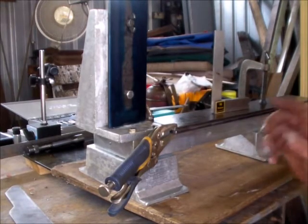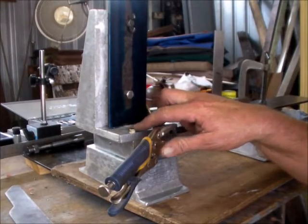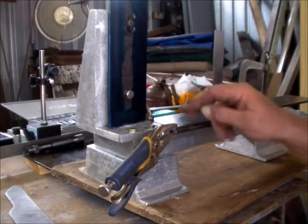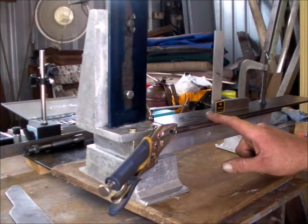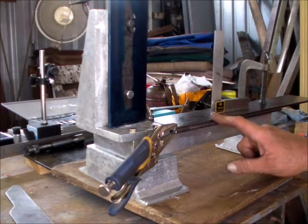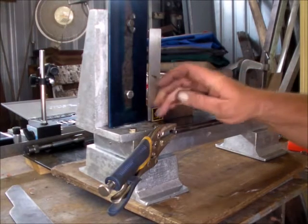The alignment is good — it takes a lot to get the alignment there. To help keep the alignment, I've still got to put some star washers underneath all four bolts. We're now going to align this edge 90 degrees to the bed. This is actually the temporary work table material — 3 inch or 75mm — mounted onto the bed because of the step of this base; it clears the base.